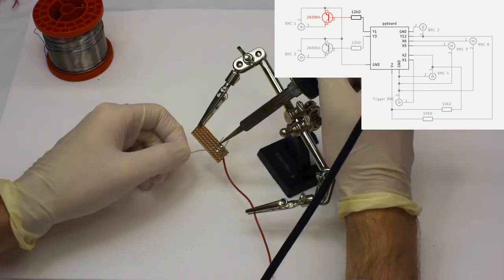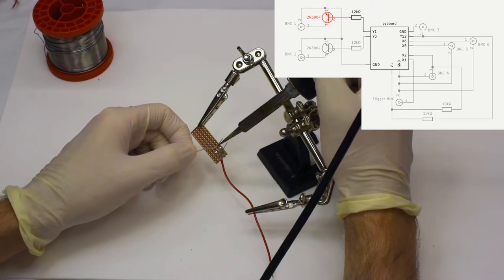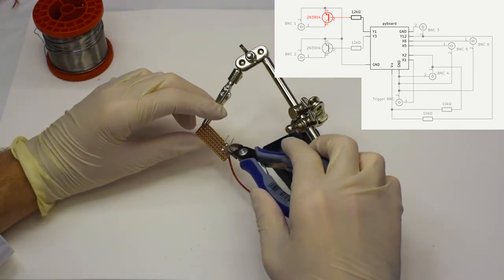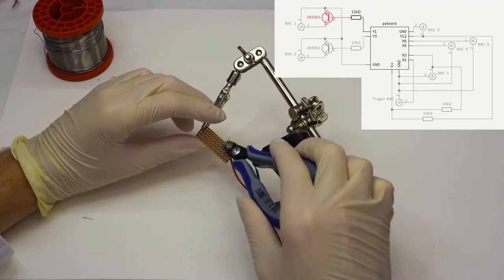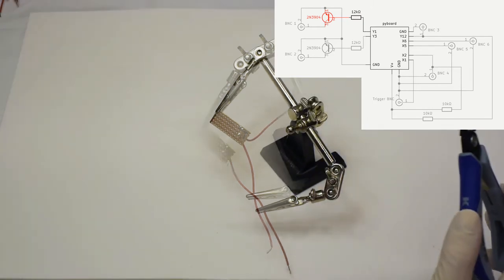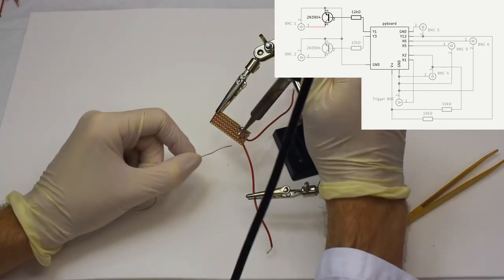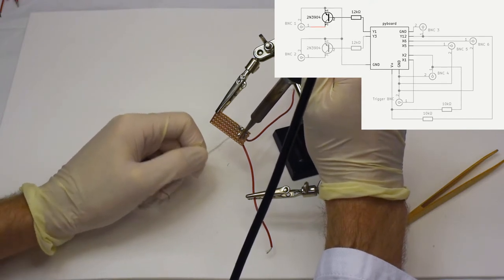The not putting too much metal bit comes into play here, simply because you have a lot of connections close to each other. Again, we can cut off the rest. This is not just to make it user friendlier and less prone to scratching you, but also to avoid accidentally connecting things together. For instance, if a piece of metal touches something, or any of the excess connectors somehow end up touching each other. We have one more cable now, which will connect part of the BNC port to the transistor.